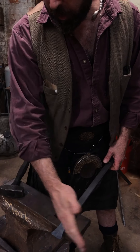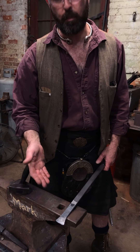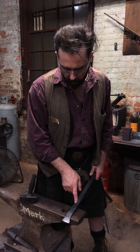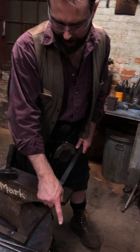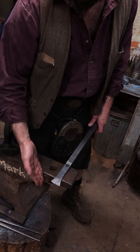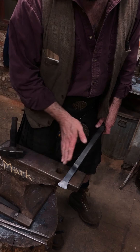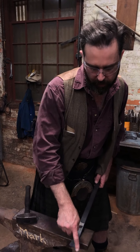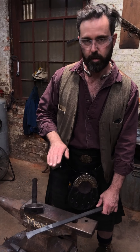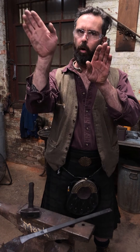Through the midriff it's just a progressive, flat hammer blow down to the tip. Your geometry of this piece is based upon how much work you've done in each area. If I work excessively down one line, that line will stretch and your ends will become uneven. You've got to make sure that you work your lines evenly — running to the left, running to the right, running down the center evenly in order to get your material to grow evenly.